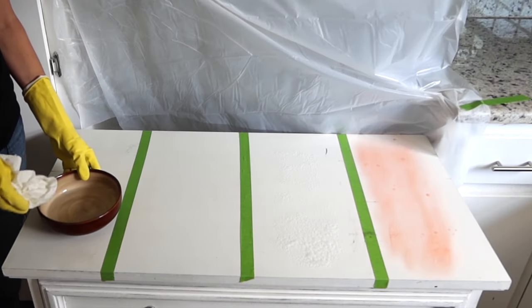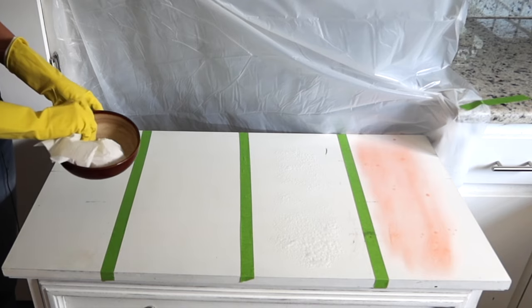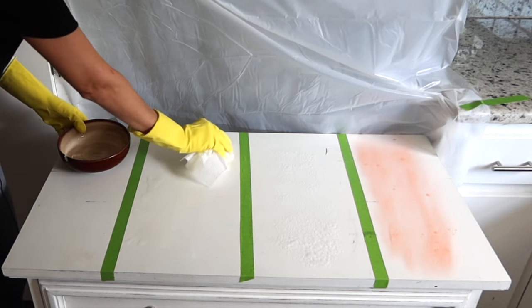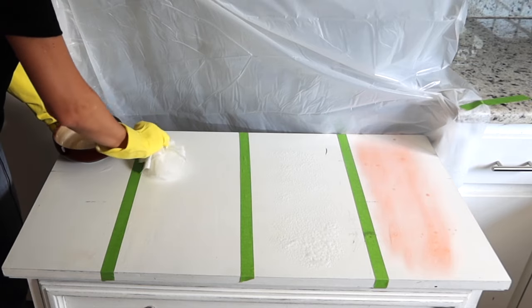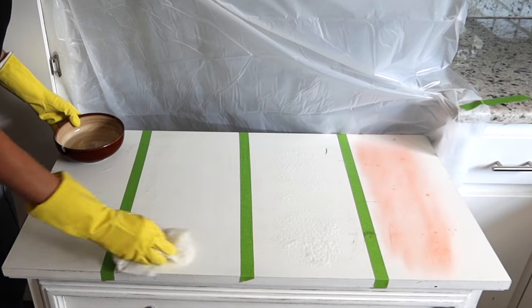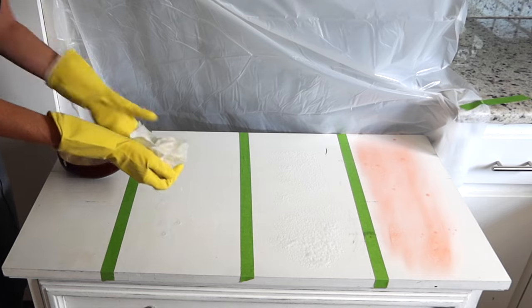With the white distilled vinegar, what I'm doing is I heated it in a microwave-safe dish for 30 seconds. I'm taking a paper towel and just going to rub it on top. Most of the articles I read say to leave it for 15 minutes, so I'm going to rub that on there and then leave it to see if it will soften the paint off of the wood.